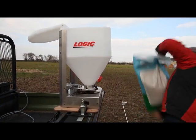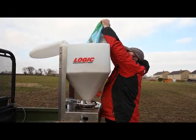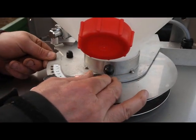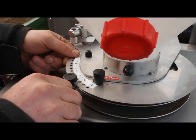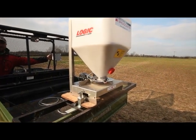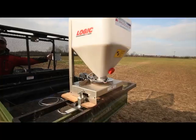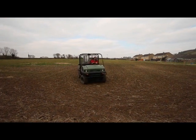Finally, let's show a quick shot of spreading grass seed through the electro-broadcaster. With this application, you adjust the bias setting to 12, which will centralise the spread of the seed. Then open the output between 8 and 12 to give the application rate required. The maximum spread width is 6 metres, because the weight of the seed is the limiting factor, so always use the machine at the highest motor speed — unless you want to reduce the width to fit with another implement, such as this Logic 2-metre harrow, which is being used to patch up badly worn areas of a paddock whilst the electro-broadcaster spreads the grass seed at the same time.